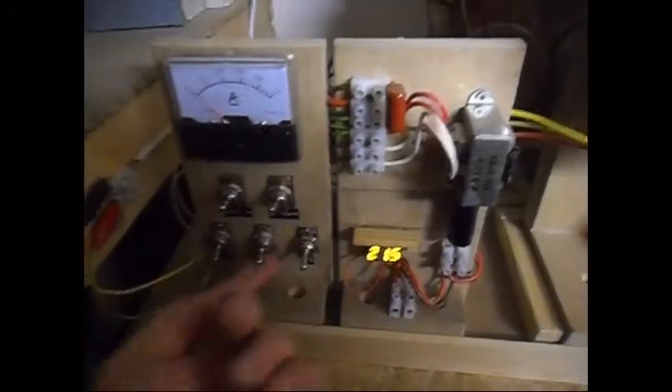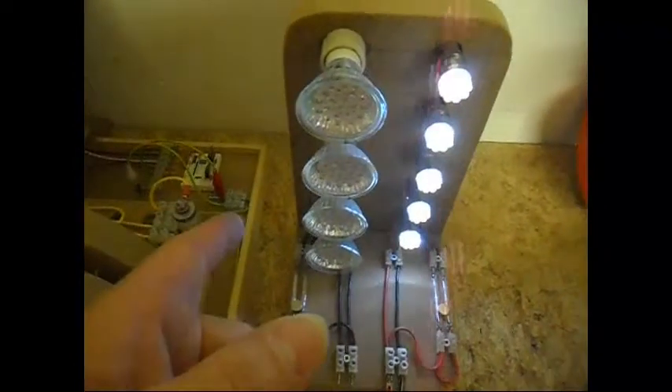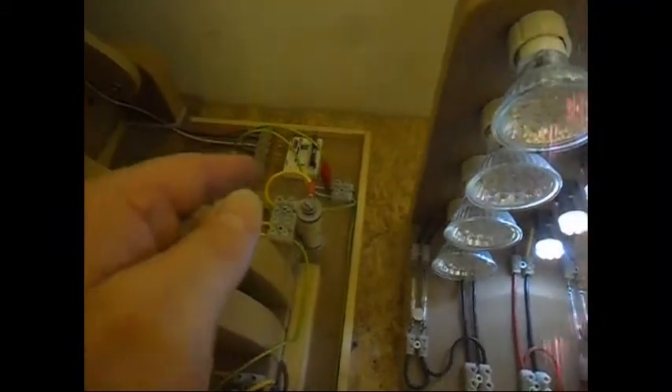Going to switch it on. I'm driving it with the load on it, because if I drove it without the load and then engaged the coil shorting circuitry I would blow out those two high-voltage MOSFETs — they're rated at 500 volts maximum and my voltage output on that part of the system is around 900 volts — so no. I have to run it like this.